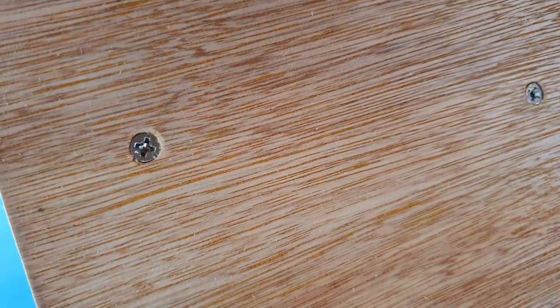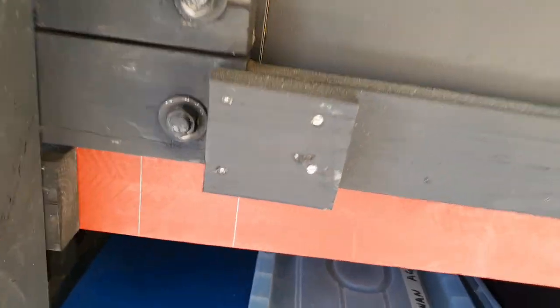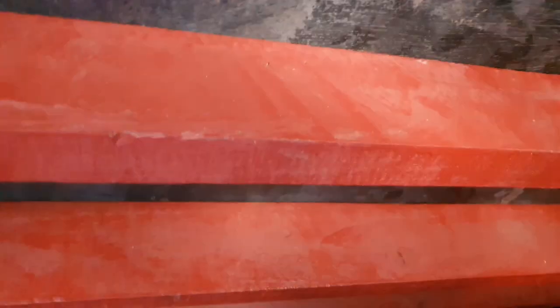One important thing to check for with your screws is actually going to be on the back. If you have kids or if you want to do storage or if you're ever going to come and back, you have to look and make sure that the screws hit your 2x4s. Also, it's not going to be as strong if they don't. So you can see here, I'll turn this around. You see here we have 3 misses. So John, why don't you pull those out? And you have to just take them out and do it over.